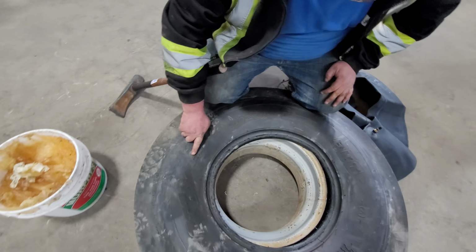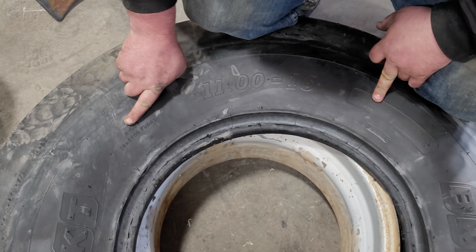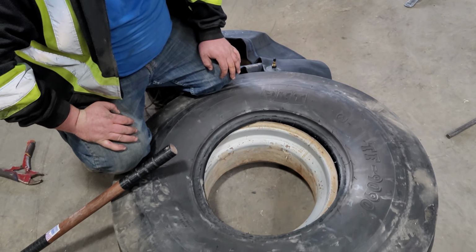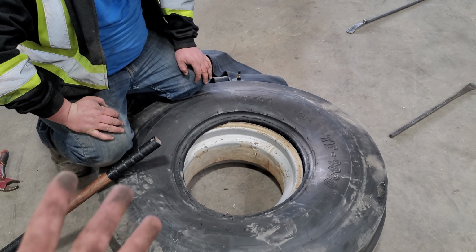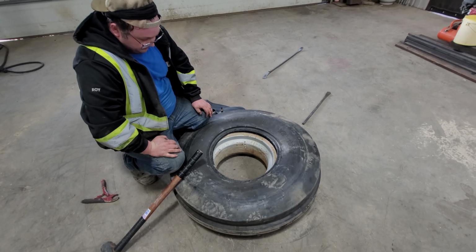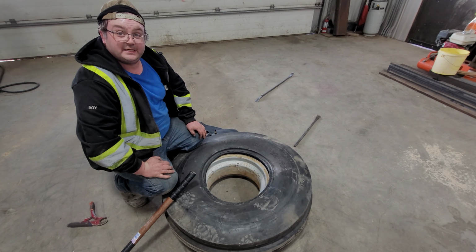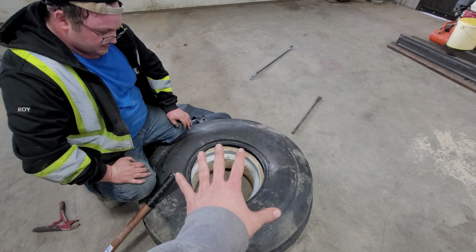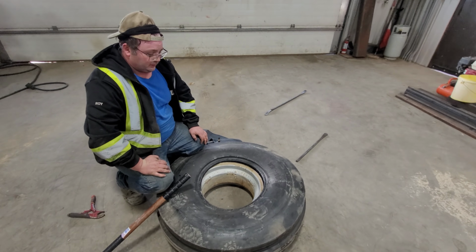It's a nylon tire, so it's bias. It's 8-ply. What's the scale of ply? So 4-ply is a standard load. Then there's extra load that's about a 5-ply. Then there's a 6-ply, 8-ply, 10-ply, 12-ply, 14-ply, 16-ply. So would an 8-ply be standard on a tractor tire like this? It all depends. I've seen them up to 12. It all depends on what the customer needs.